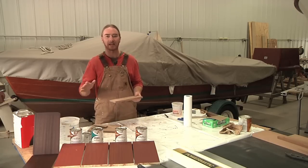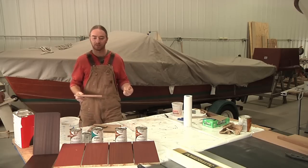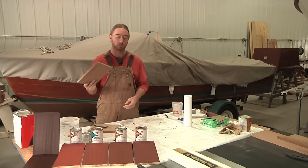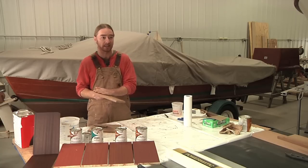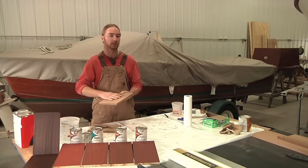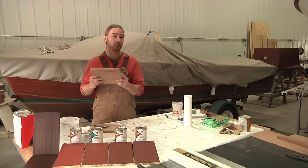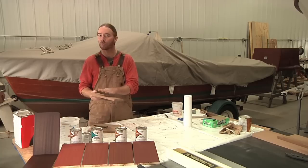A common thought is that on a classic runabout with that glass-smooth, mirror-perfect finish, the surface must have been mirror-smooth before staining — but that's not true. When working with solid wood, I'll sand the surface using 80-grit paper, sanding with the grain by hand — I don't use a DA or random orbit sander for my final prep. Then the final touch is I wet the surface down with water to raise the grain even more, which lets you hold more stain and get a more uniform appearance.